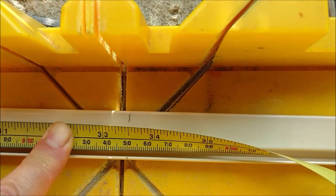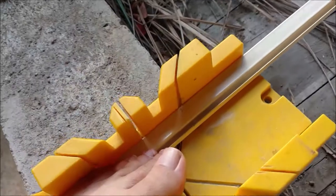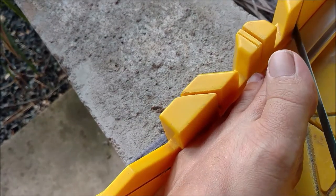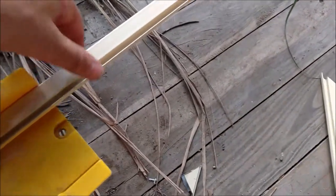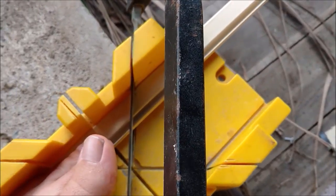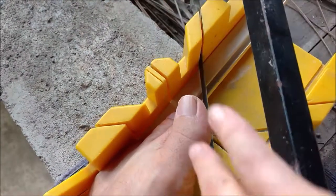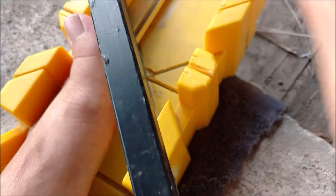I've got my tape stuck to the end of my frame and I've made a little pencil mark at 850mm. I'm going to use the mitre box to cut a nice 45-degree angle across, and I'll show you how I'm going to do that without kosher methods. I'm placing pressure with my foot to stop it from sliding — I wouldn't ordinarily do this, but the guides and the mitre stop the blade from coming out. I'm just going to gently start sawing. I'm now going to use two hands to hold the box, so I'll turn the video off.